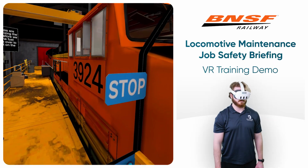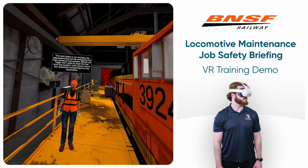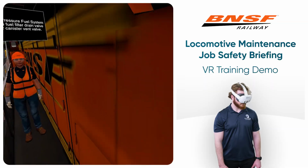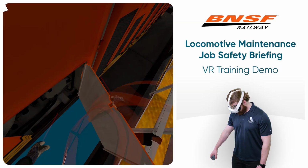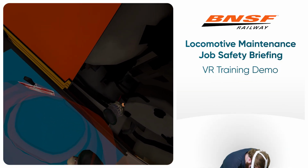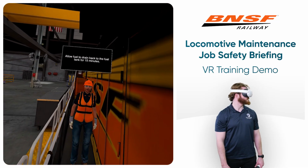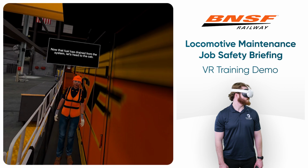The next steps in our process are depressurizing and de-energizing the high-pressure fuel system. Before we begin, we'll need to drain the fuel from the system. Vent the low-pressure fuel system by opening the fuel filter drain valve and fuel filter canister vent valve. Allow fuel to drain back to the fuel tank for 15 minutes. Now that fuel has drained from the system, let's head to the cab.